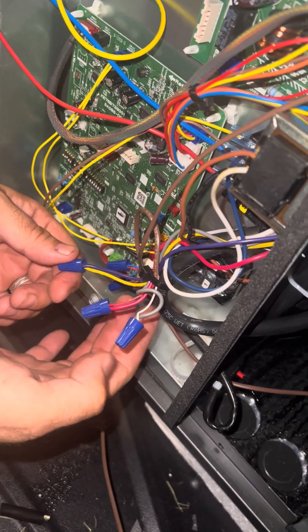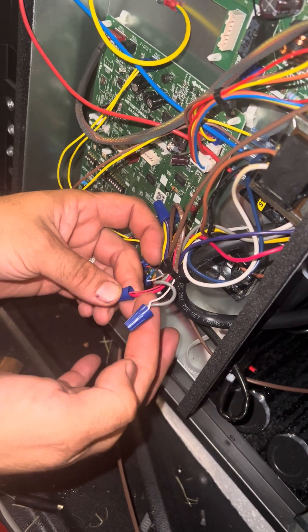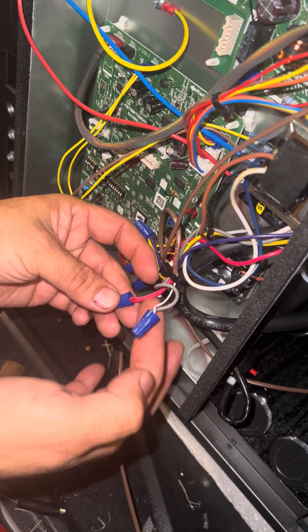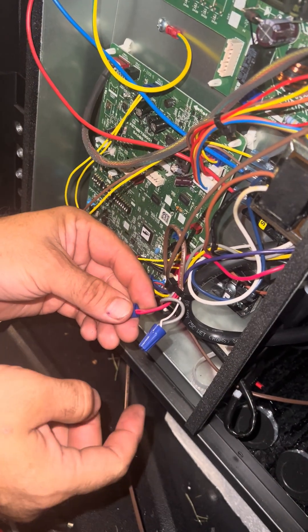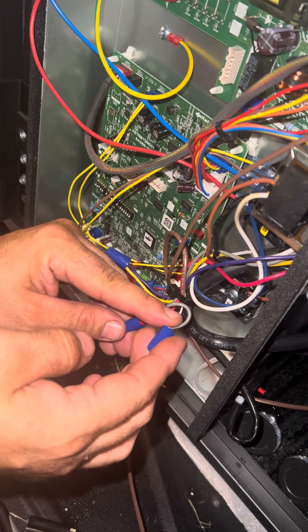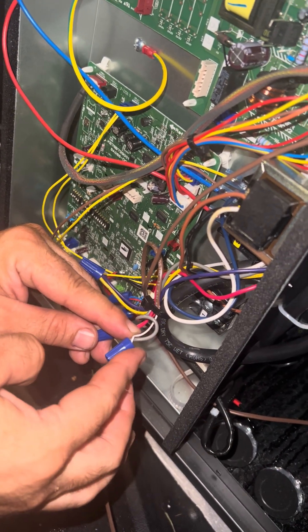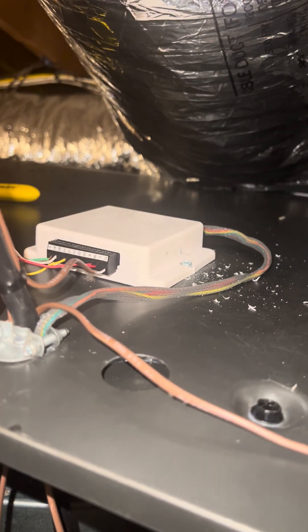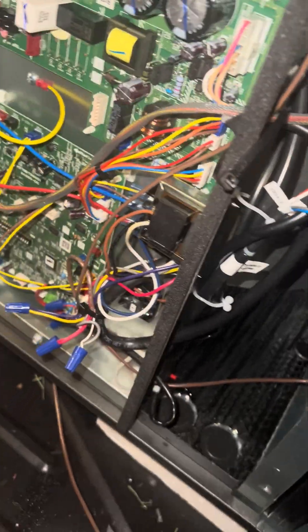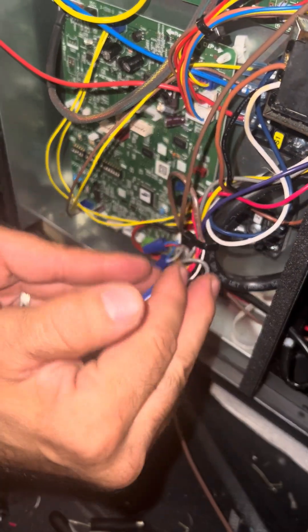To gain the low voltage 24 volts, you have to tie together the yellow and violet. That leaves your red and gray — red being your 24 volts, which hooks up to the TR side, and gray which is your common going to the TC side of your terminals on your thermostat control box.